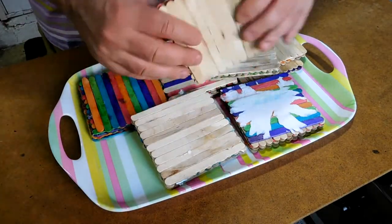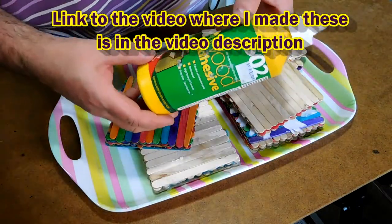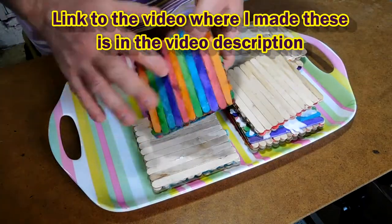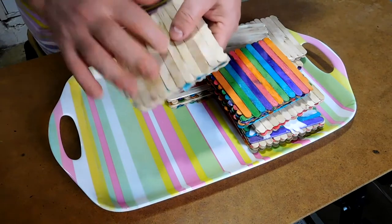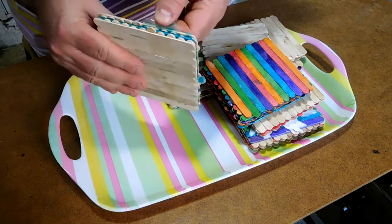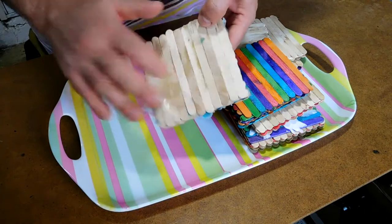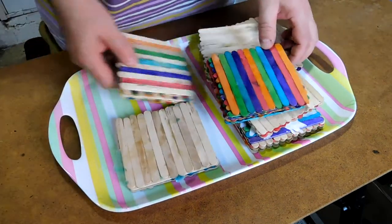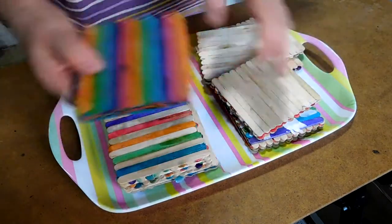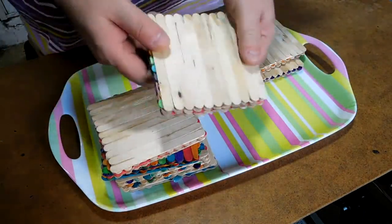Let's have a look at the results of our rainbow ply experiments. This is using PVA type woodworking glue, 502 wood adhesive. The good news is they've all dried very nice and flat. Some of the colour has leached out into the water-soluble adhesive, but I don't really think that's going to be a problem - it might make it a bit more interesting. They all sound really nice and solid, no hollow sounding and no rattling at all. I think what we've achieved here is a solid product, which is exactly what I was hoping for.